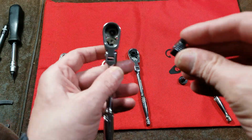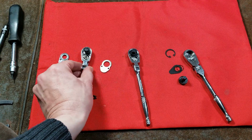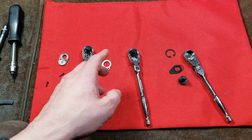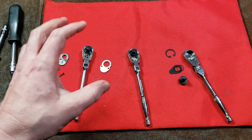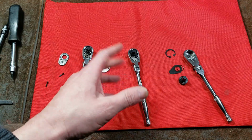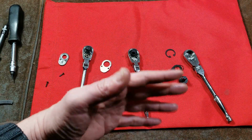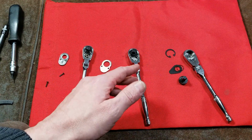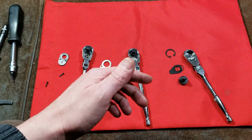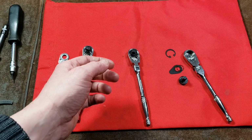We know that in those situations, you want thicker gear teeth. If you take apart a big electric drill that has multiple gears that are being reduced, as the torque goes up, in each gear stage, the thickness of the gear teeth themselves gets larger. And it's really been proven for years and years. Things like Milwaukee Sawzalls are a great example. You get some older Sawzalls and you'll find some little motor spindles that have 6, 7, 8 teeth on them, but they just end up wearing, there just wasn't enough cross-sectional area.